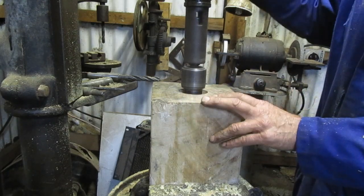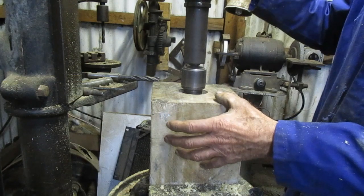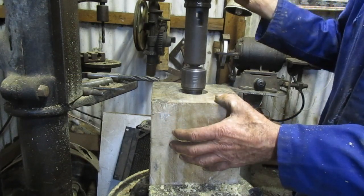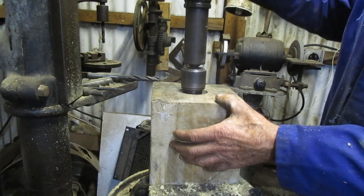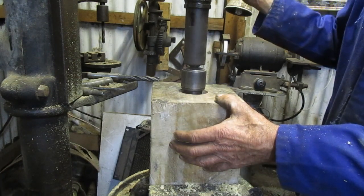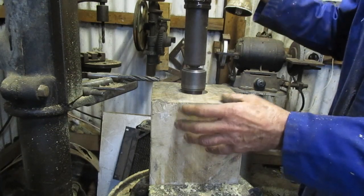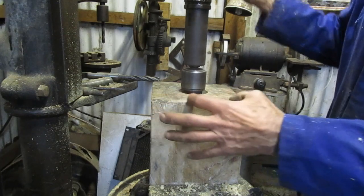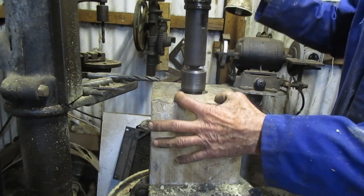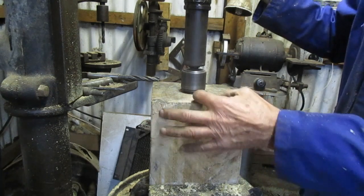When I made this originally, it did worry me the whole time how I was going to be able to tilt the stone spindle if I had to. That is done by moving the foot bearing of the stone spindle in a box with four screws.